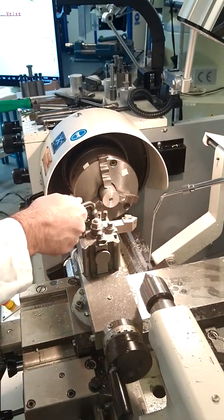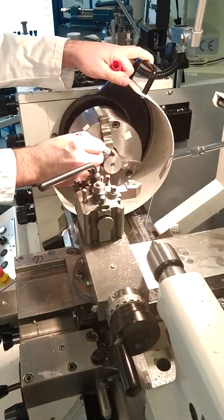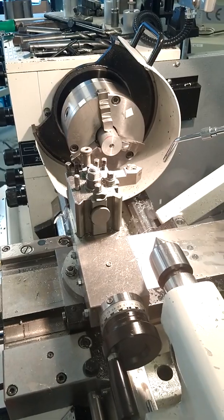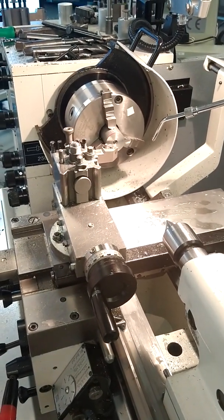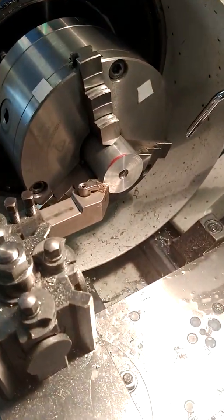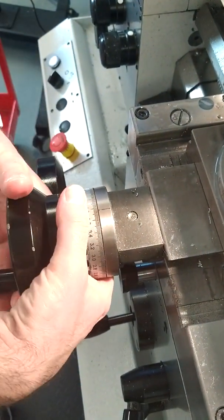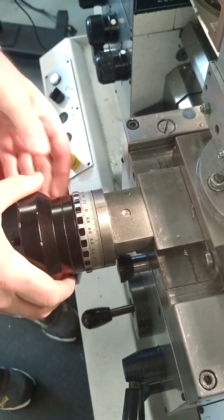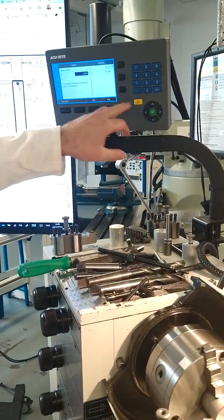And now we're going to apply a chamfer of 1mm onto the finished edge here. To do that, come back with your tool and turn the coolant off for this process. What you do is put the tool up against the edge of the part, in position like so, and you zero here on your cross slide. So you're tightening in and you open across, sliding this one to 0. You make sure there's no backlash. Then checking on your DRO, you reference X to 0.